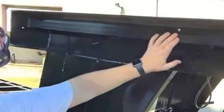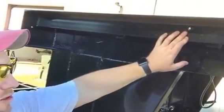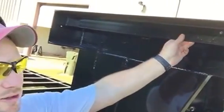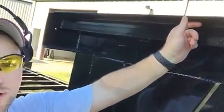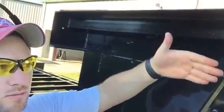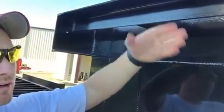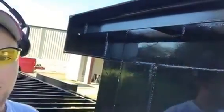You can see I pre-drilled some holes because this is some thick steel, to get the 2x8 to really go flush against this. There'll be a little bit of gap, so when I finish my house I'll have some trim on the outside, but in the meantime I want to make sure this entire area gets insulated. There's 8 inches of foam down here all the way to the outside of the trailer.